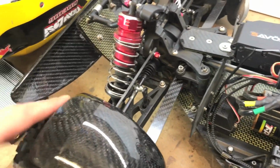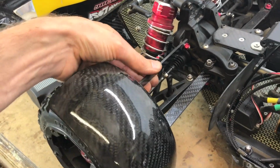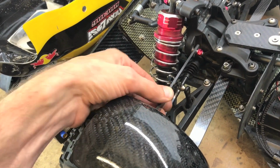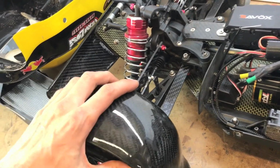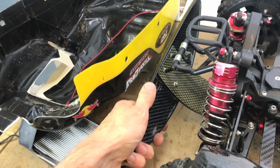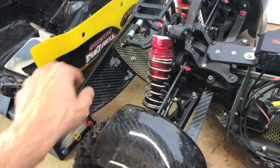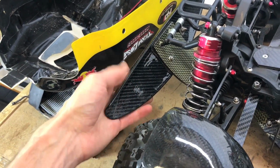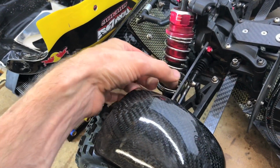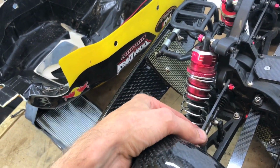Like I mentioned before, carbon fiber turnbuckles and the steering arms. You clearly can't adjust them, but to be honest, they take me about 5 minutes. I'm at my workshop, I'm a furniture maker by trade, so that's why I've got access to making carbon fiber things. These start as a roll of carbon fiber, and you just put epoxy over an MDF mold to make these. And then the turnbuckles are just flat carbon fiber. Cut it to 16mm wide, drill some holes, and you're done.